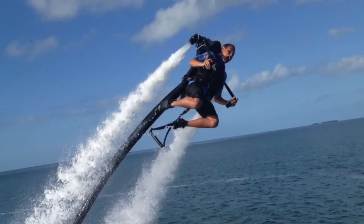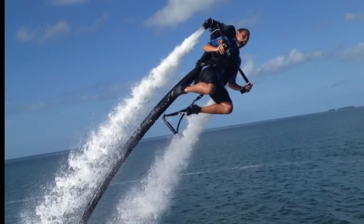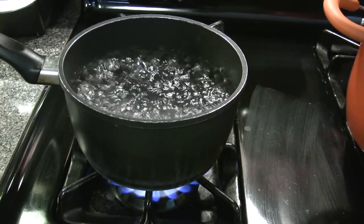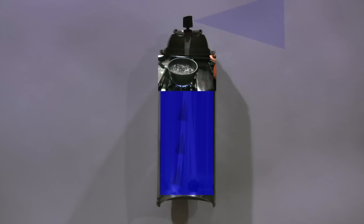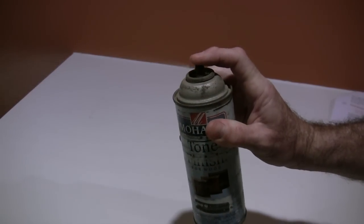One of the advantages of using liquid propulsion is that the pressure maintains constant as the product is being used. This is the same principle as liquid propane, or LP, on your gas grill — it's pumped in under high pressure, which causes it to liquefy and maintain a liquid state. As long as it's not allowed to expand into a gas by releasing that pressure, it will stay a liquid. When the valve is open, the pressure starts to reduce, causing the liquid propellant to boil — not really boil as you and I know it. This boiling process simply means that the particles begin to break free from the liquid and become gas, released into the headspace and creating pressure on the contents of the can. This pushes the product through the dip tube, and some of the propellant is mixed with the product and leaves the can as you spray, rapidly turning into a gas and entering the atmosphere. The ratio of propellant to product depends upon the chemical makeup of the product, the use, and the desired delivery effect — whether a fine mist, thick foam, or anything in between.